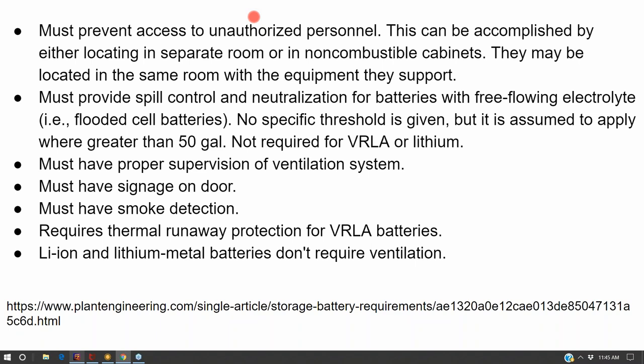So, this is hot electrical stuff, and even if it's protected physically, there's still an element of danger there where you don't want the kids getting into the battery room and playing around with it. As an installer, you have to be very careful. You don't want to drop a wrench into the battery and cause that wrench to light up with flame. You can get kind of lazy and start using the battery as a shelf and get messy. You don't want to do any of that. You want to, hands off, dust free, protected, locked.